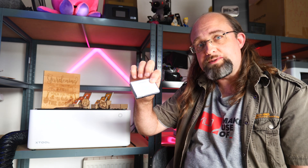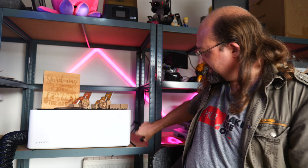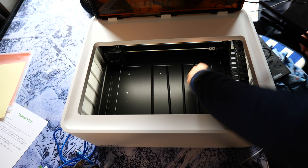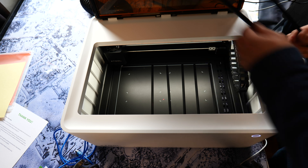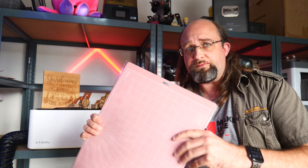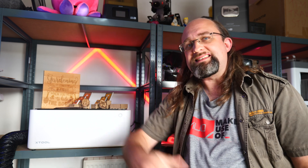Supplied with the M1 version we received was a small sample pack of materials, a pack of 45-degree cutting blades, and a set of triangular prisms to lift your laser cut project off the base, which results in better quality cuts due to increased airflow underneath — you'll get less burnt areas. In addition, you get two cutting mats: one for a light grip for things like vinyl sheets, and a stronger grip for things like fabric. These are consumables and should be replaced once materials are no longer sticking or they're too scratched up.